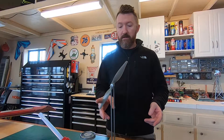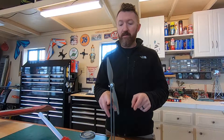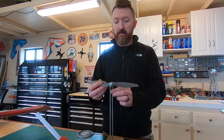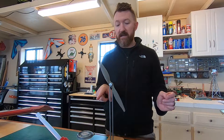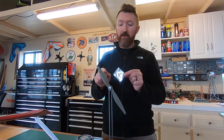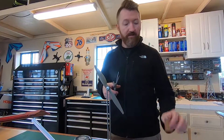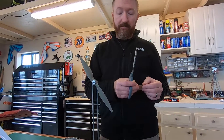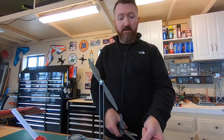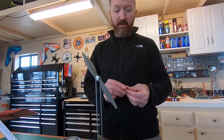No matter which position you set it in, this is the heavy side. So you can see this is the heavy blade. There are two techniques: you can add a little bit of aluminum tape to the light side, or some people sand material off the heavy side. I'm just going to add a little bit of aluminum tape on the light side. It doesn't take much — I'll cut maybe about five-sixteenths of a strip and start with that to see where we get.